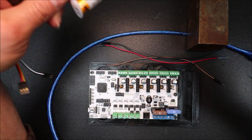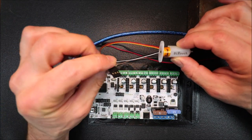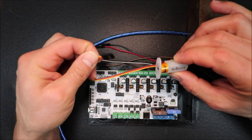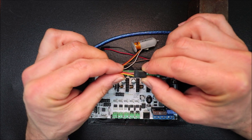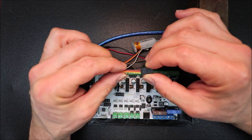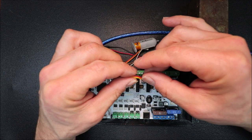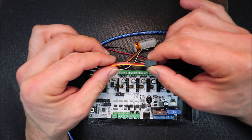The BL-Touch uses what's known as the servo connector on this Molex connector. As you can see, there are three colored wires: a dark wire, which in this case is brown, and that's our ground; then we have a red wire which is our voltage; and then we have a yellow which is our signal.